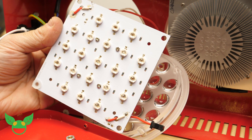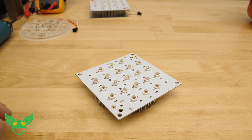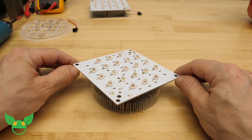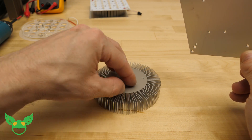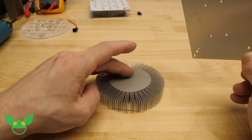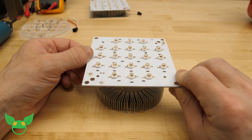I'm not here to debate whether you should hack this light, but if you want to, let's cover some of the options that will fit within the voltage range of this 55-watt driver. The circuit board itself is acting as the mounting substrate, which is definitely a very savvy cost-saving maneuver. After unscrewing the PCB from this little baby heatsink, you find something you don't really see every day in an import grow light — a really nice silicone thermal pad that looks to be reusable. I think we're going to go with a COB on here, and we could even use that pad if we can find a COB that matches up with these holes — otherwise you might have to drill some new holes.